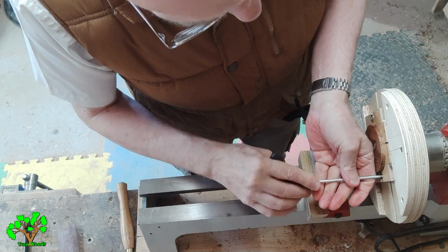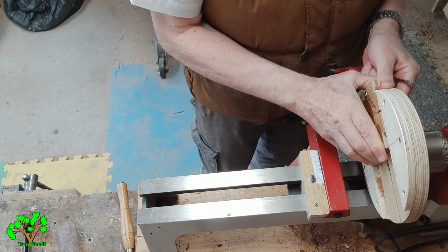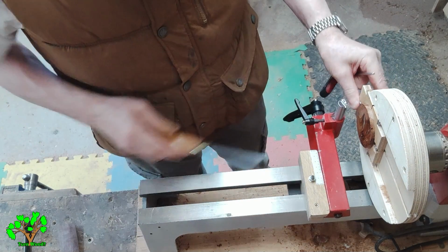Having set the tool post at its minimum position, i.e. dead centre of the lathe, I'm now seeing if the scale covers the full range to the actual maximum diameter of the base plate.